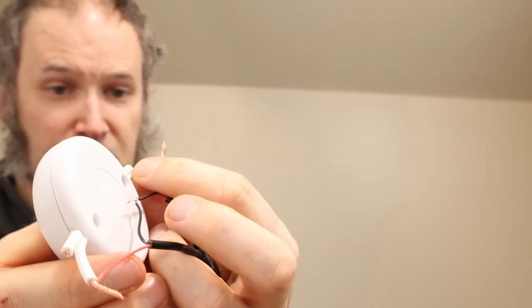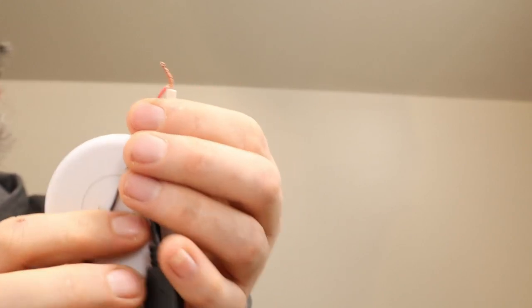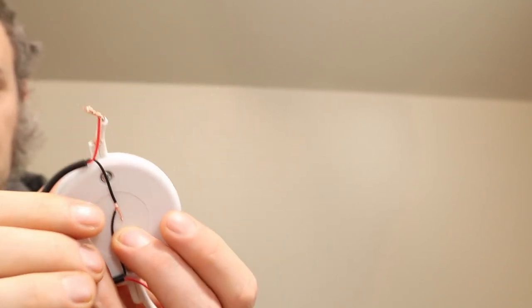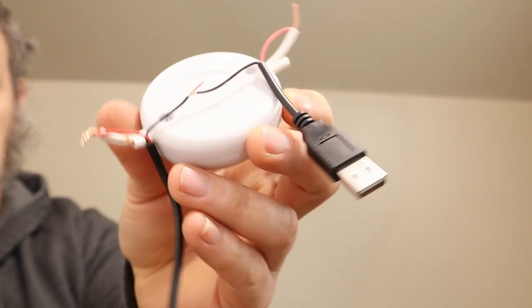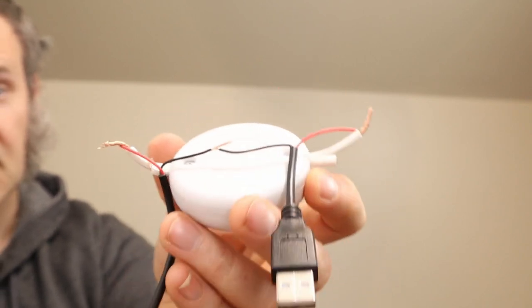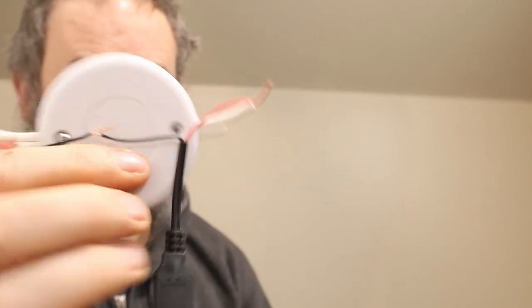Remember, you want to make this cable a lot longer if you're doing it yourself — figure out the length that works for you. Here you can see I've attached the red USB wire to one side of the foot switch, and the other red wire from USB to the other side of the foot switch, and the two black wires from USB are just twisted together. At this point, put at least electrical tape on them to protect them — you could solder them and then tape, or use some kind of connector.